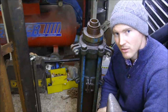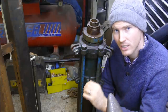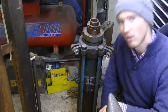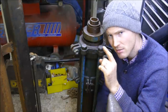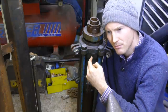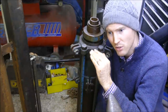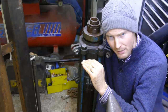And it made me research a few things on the internet, and that is an air over hydraulic system, which is essentially meaning that I attach a small cylinder to the pump of this bottle jack, and if I make that cylinder reciprocate in a similar way that I did with the power hammer, then essentially this becomes a powered hydraulic jack using my air compressor. But obviously that cylinder can move incredibly faster and with more force than I can by hand.